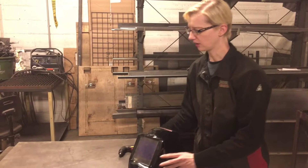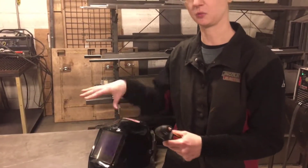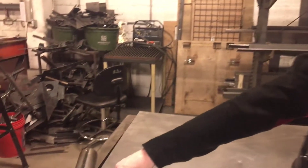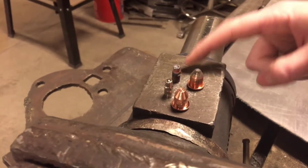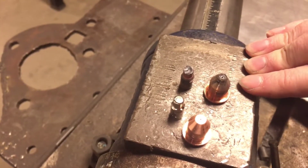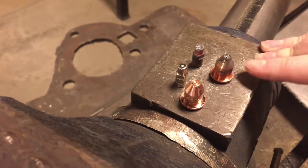We're also going to go over something you should check every time you use this tool, especially at Idea Foundry with it being a community workshop — you don't know how much it's been used before you've come in. I have an example of a brand new electrode and a really wasted one. We can't use the wasted one; it won't give you very good cuts. Most of the time the electrodes come with a new copper tip as well, so go ahead and replace that so you get better air flow.